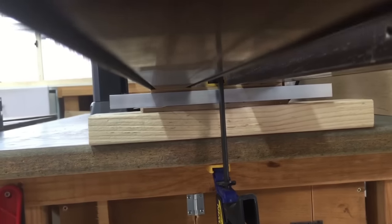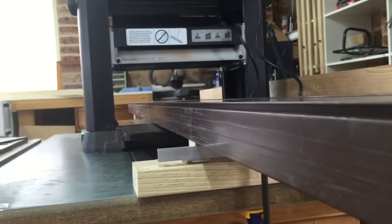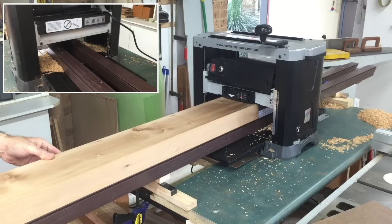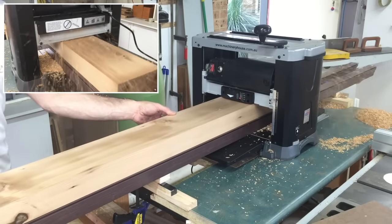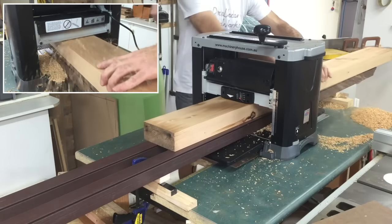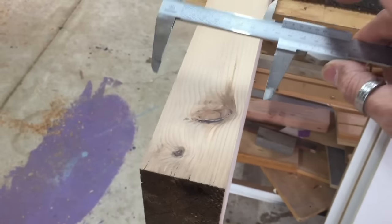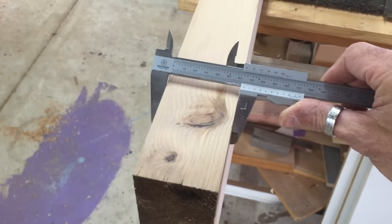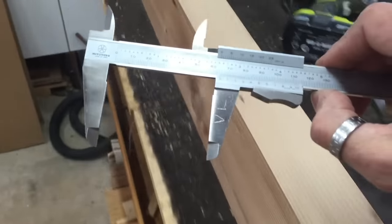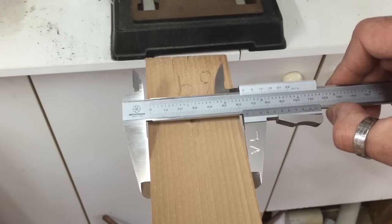You can see that I've done some fairly precise packing to get these aluminium bars dead flat through the thicknesser. And if we just take a look at the top — you can't get much better than that. Just to show you how well that worked out, I used the verniers to take a measurement down this end and I've got 64 millimetres exactly. Taking those verniers up the other end and putting them on there, that's a very, very snug fit. That's perfect.